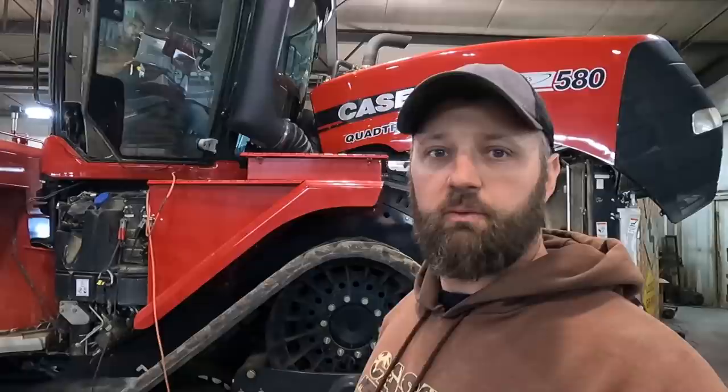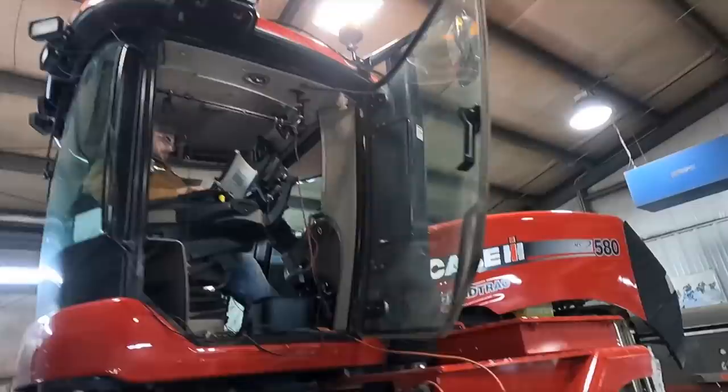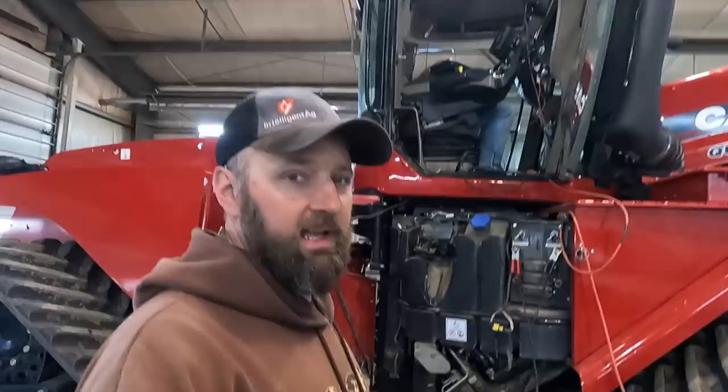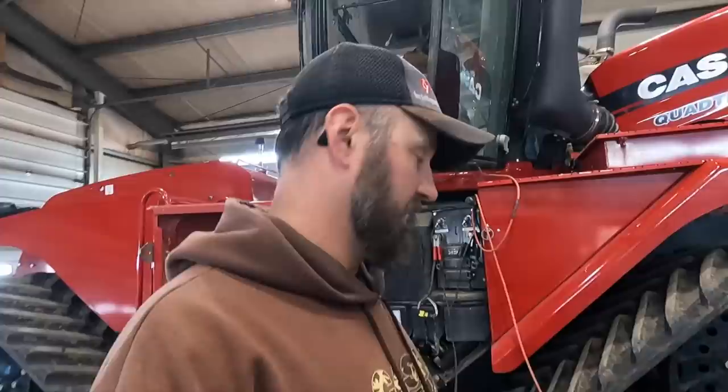Well, Kenny just ran the last test, and it came up with no faults. So you would clear them now? Yep. Clear all the previous faults and maybe we'll fire it up and see if it works. Well, no light again. Everything seems to be checking out. We really don't know what happened. Maybe we had some frozen DEF in it when I first started it up and it was plugged up and didn't want to pump. And finally it's cleared out after you changed the filters, but I don't know. It's good to go now.